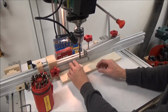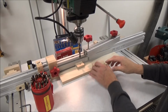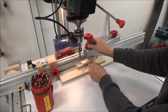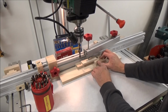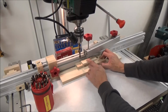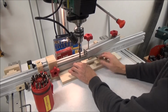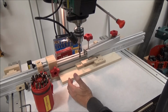And then I did drill this, by the way, on here. Right there is where I located it. And this is the way I held it down. I used a wooden step clamp this way. Or I could have, I should say. I didn't, but I can create a wooden step by doing this. Just make sure that the piece that you're drilling is the same thickness as this step out here, and then you're good to go. But that's it right there. Clamp. I think I can give that like one turn because that's got some flex to it. But you can see there that's held in place, and that would work out well too.